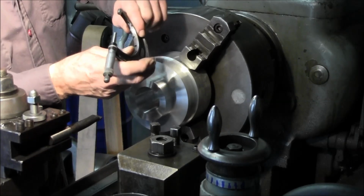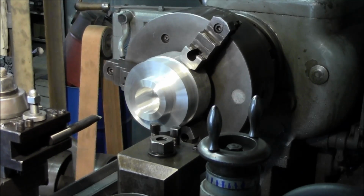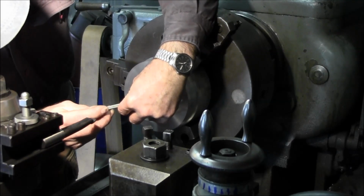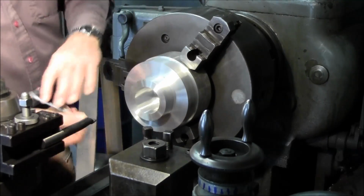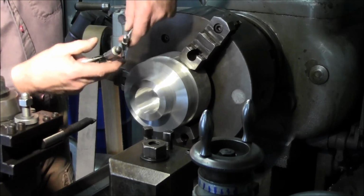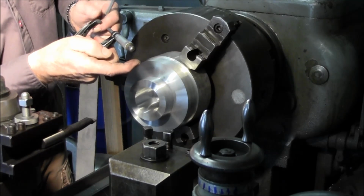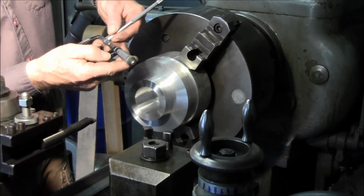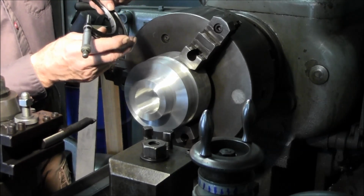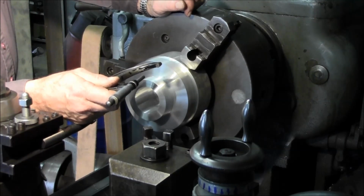Okay, 187, and I am getting 5 tenths. But let's go ahead and drag snap gauges through here now. Wasn't quite comfortable holding my arm like that. I knew I moved that. Did you see that? Alright. 187. And I'm getting like 4 tenths. Alright, I'm pretty happy that I can come within a tenth of what we want.